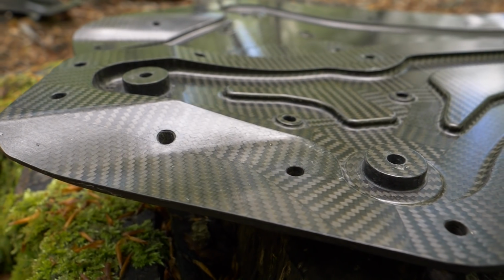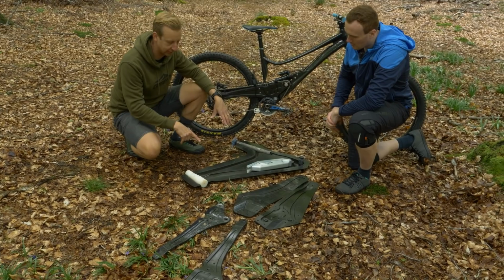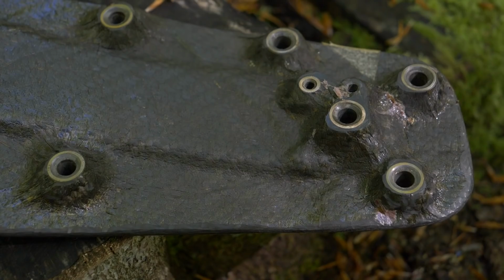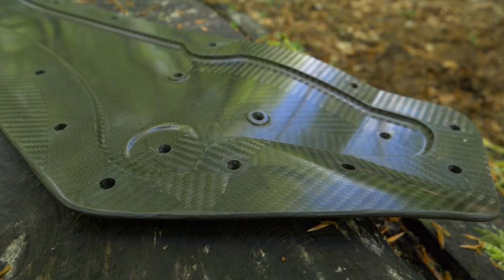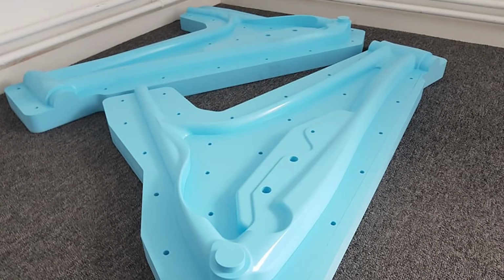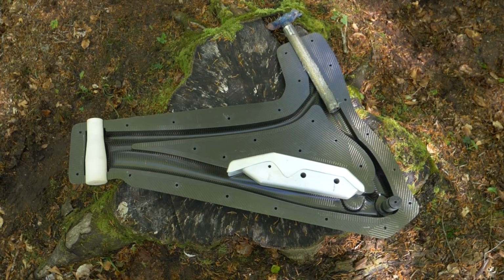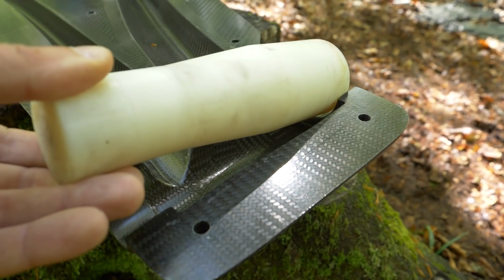Okay, so talk me through what you've got here, because even the manufacturing of these looks extremely complicated. With these carbon fibre mould tools, these are the tools I've used to make the bike itself. To make these, you had to machine a separate block of material, a low density epoxy block. Yeah. And then you laminate this tool from that block. So this is just one half of the main frame tool here. And as you can see, I've got all the other loose tools in it.